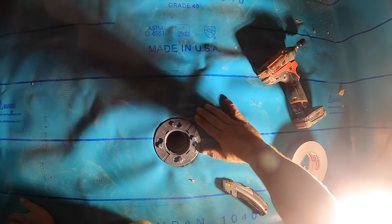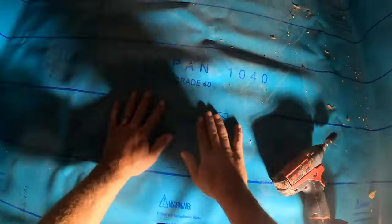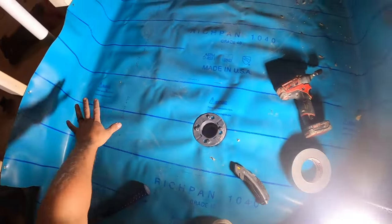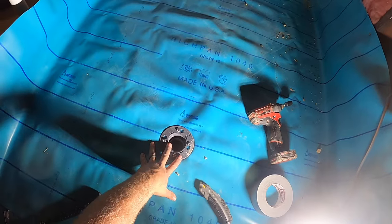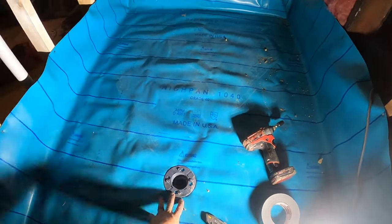And so with that, any water coming in here, I'm gonna tuck all this back into our corners, but any water that's coming in here, it's gonna drain out because I got a good half inch of slope here. And whatever doesn't go through the concrete, it's gonna come off the tile.